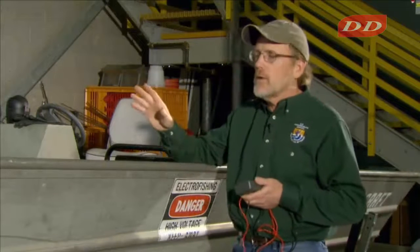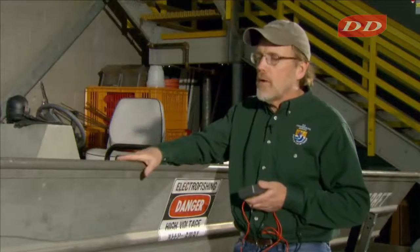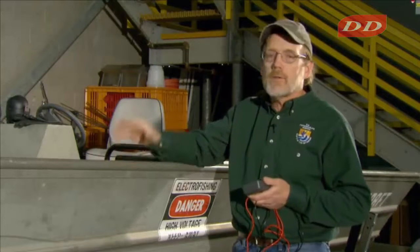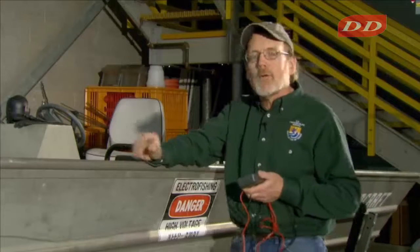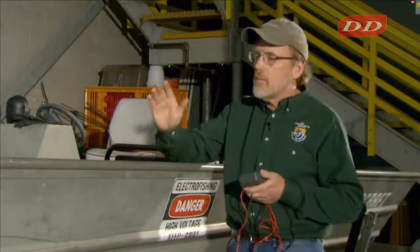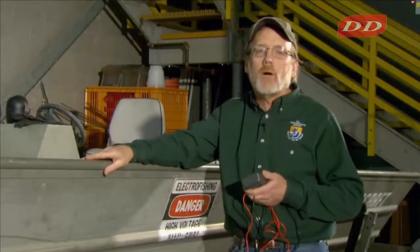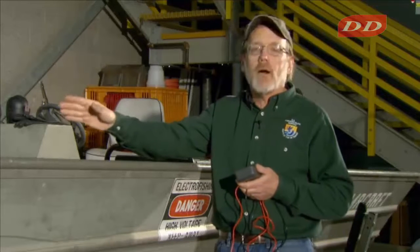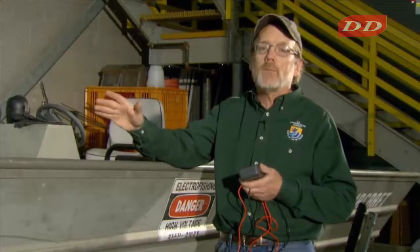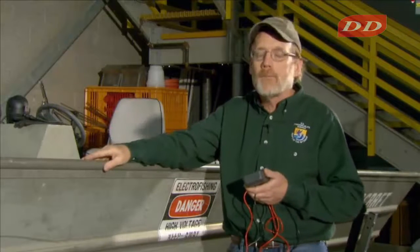Boat electrofishing is a little bit unique in that the crew is isolated from the electrical field in the water. Most boat hulls are wired as the cathode, and so you're standing on an electrode. In boat electrofishing, you're somewhat like a bird on the wire. The bird can be raised to 20,000 volts and is fine, unless the bird also touches a conductor or something else of a different potential. And when you bridge two different voltage potentials, you complete a circuit and you can get shocked.